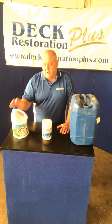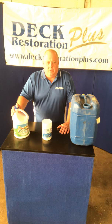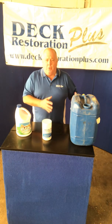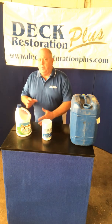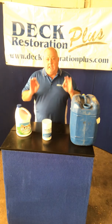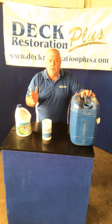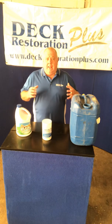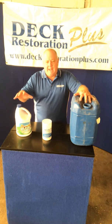I challenge you to check it out for yourself. Sodium hypochlorite is used to purify water and in restaurants for food prep and cleaning — it's a solution approved by the Board of Health for food service surfaces we eat off of. We use it to purify water, but people claim it's going to destroy our wood? We need to back off that a little. If it's misused — if you use straight commercial bleach — then yes, you'll discolor the wood, lignin will leach out, it won't rinse out, and it'll dry the wood. That's the misuse problem.